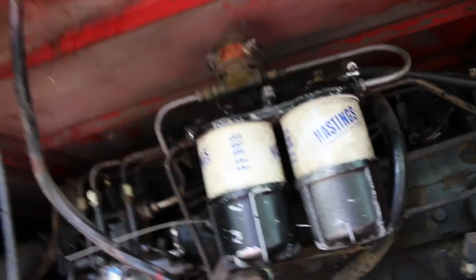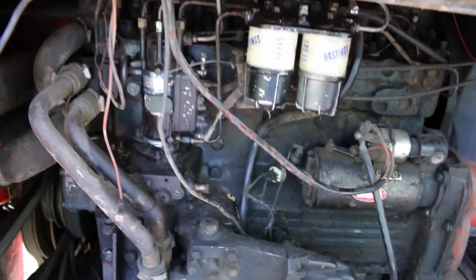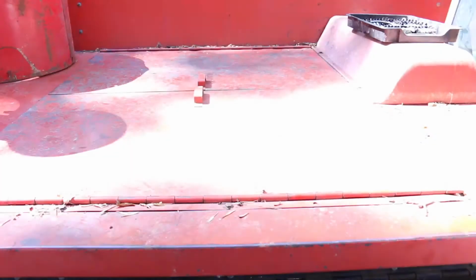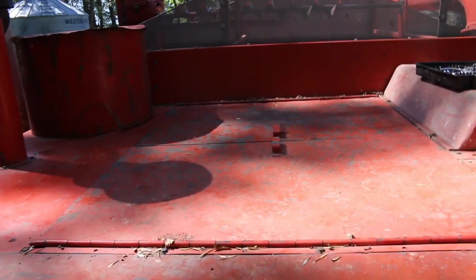We're going to fill it up, and we put new gaskets and seals and O-rings on the lines. And them filters don't look good either, but they say 95, so we're hoping we can get by for now. Checked oil, it's still good. And we're going to crack out the injectors now and run the electric pump just to bleed it, and not run the pump after that, and we'll see how it runs.